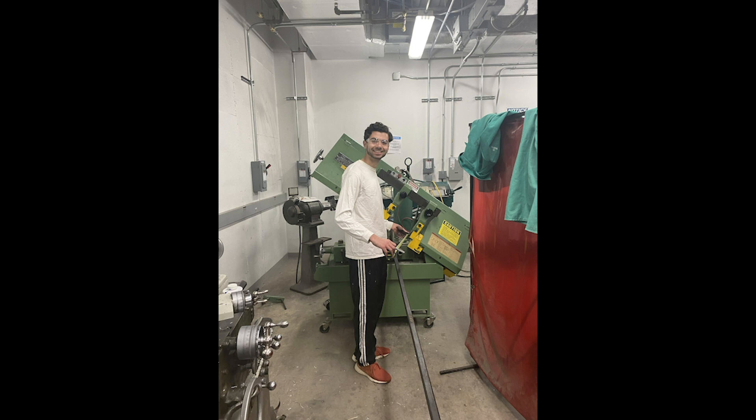However, we chose to cold bend the X-shaped section of the bridge because that allows for the weight to be distributed over a larger, more composite section. Rather than creating four different legs for each part of the X, we would cold bend two straight pieces of steel rods using pumps and interlock them into one another as well as the frame. The cold bending allowed for fewer inconsistencies in the structure when performed properly and after having been practiced.